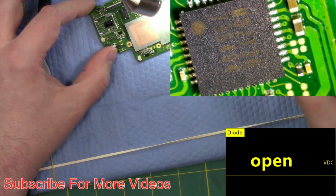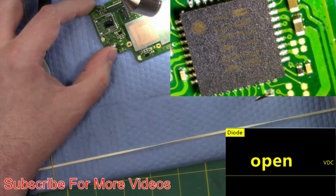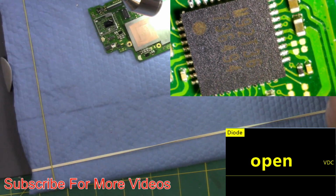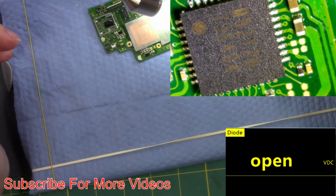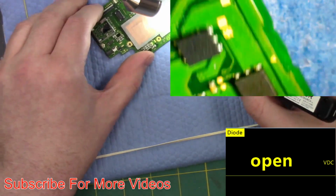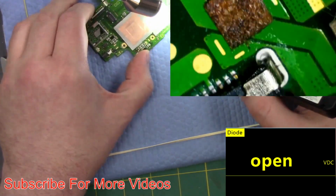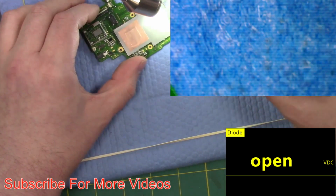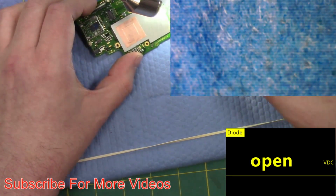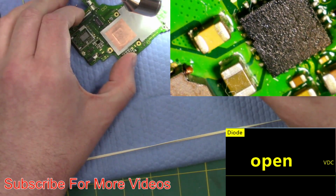And when I purchased this, again, I talked about this, I asked the guy, has it ever been opened or worked on? He's like, no, I've never opened it or worked on it. But when I got it, you can see that the USB port was replaced. It was covered in flux. You can see the flux remnants on the water sticker, and you could definitely tell that this chip was replaced.